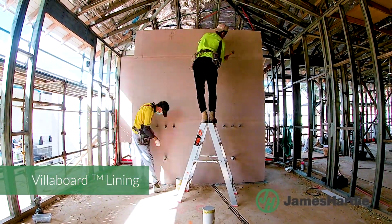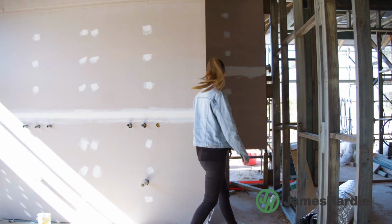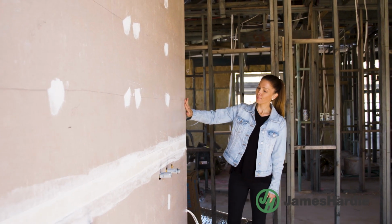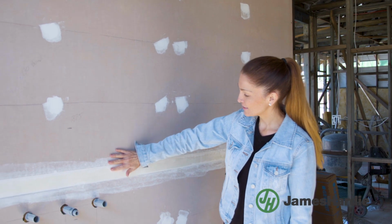Now we have used it for many years and the builder on this project, Daz, it is all he uses. So come have a look at the product over here. We can actually see this sharp edge cut here. You can see how thick it is. It's genuinely a fibre cement product, so it is resistant to damage from moisture. This means it won't rot, and it is inherently moisture resistant due to the way it is made. Unlike plasterboard, it doesn't rely on a coating.